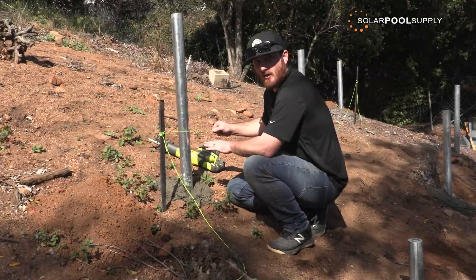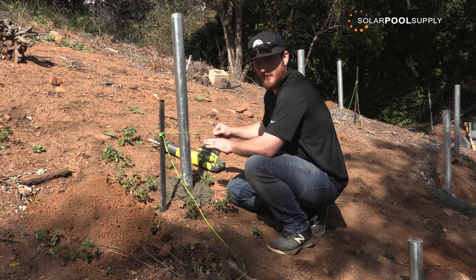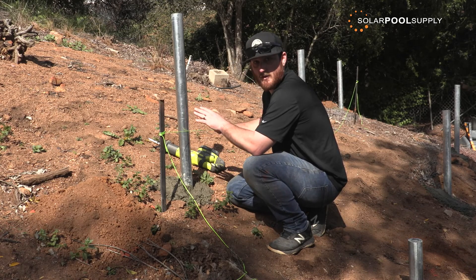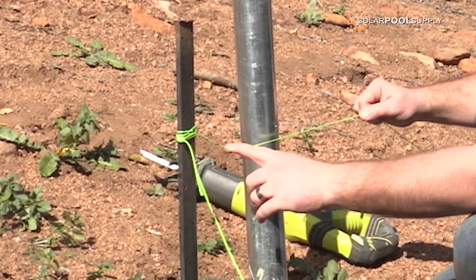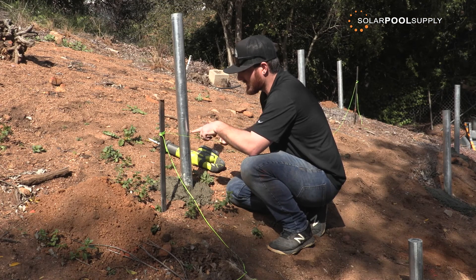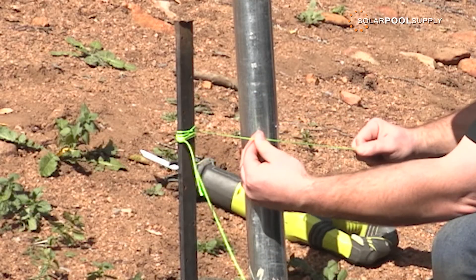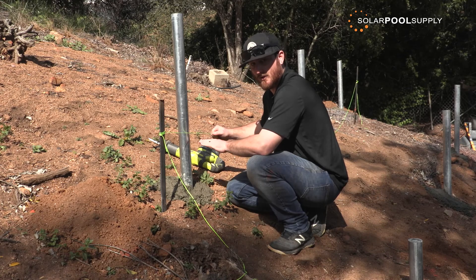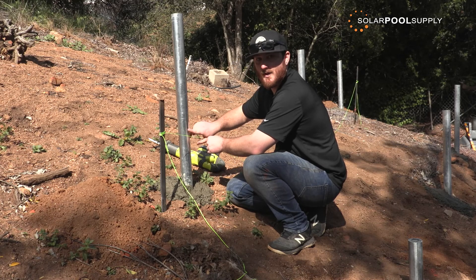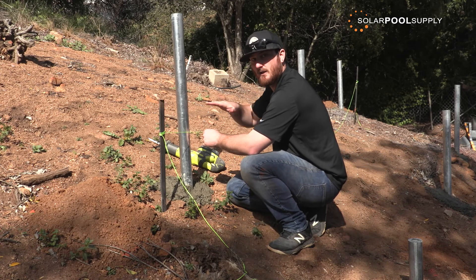After you've gotten all the concrete dry and good to go, the next step is leveling the posts and cutting them. Use the same string line that you used to mark out the holes and place the posts. Level it and try to find level. Once you've found level, the easiest way is to throw in a self-tapping screw so you can hold it up or down. When your string line is all level, you're able to make marks. The outside posts already have a hole, so that's your mark. Use a sharpie and draw a line right on the other posts so you know exactly what level is.